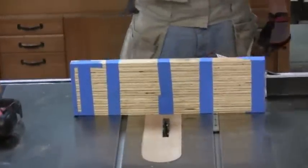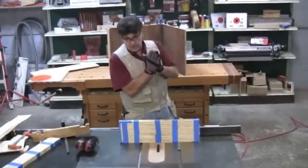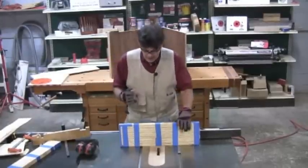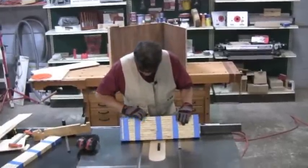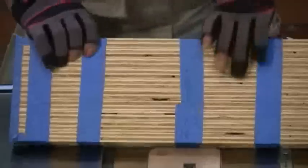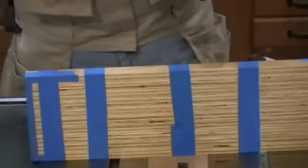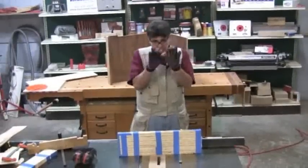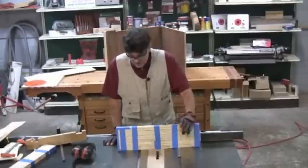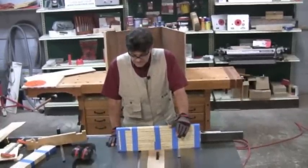Now, somebody's going to ask, can I just take a piece of the cross grain and glue it to one vertical grain? No. The reason is that if you look at plywood, you're always going to notice you've got a flat grain, end grain, flat. This is a 5-ply, but it's the glue line. You have to keep them even or it's going to warp and cup and twist on you. Now, this isn't the best plywood in the world, I'll tell you that, but for demonstration, it'll do.